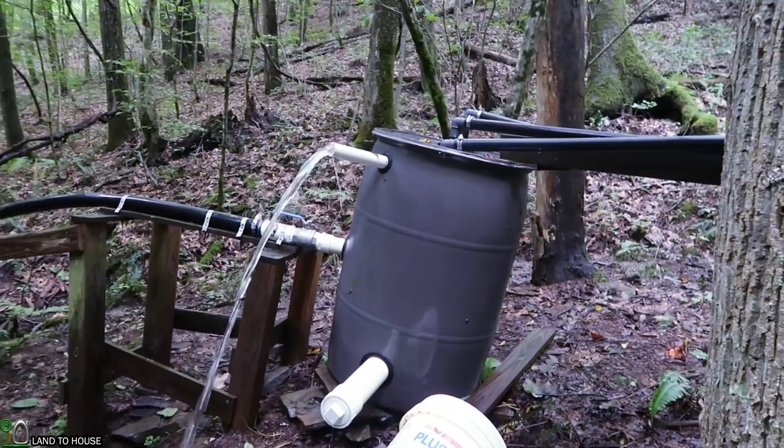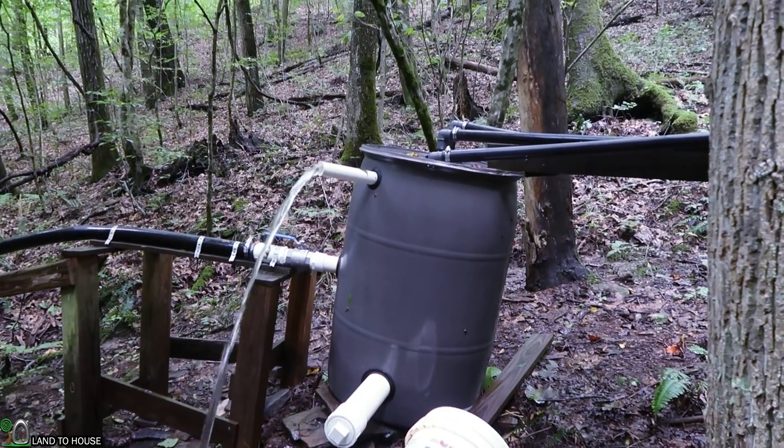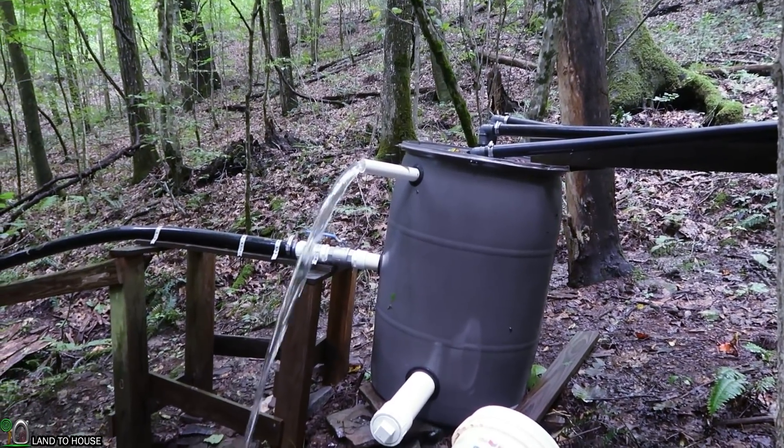If I can continue to use 300 watts all the time I'll be making $420 off of the hydro system. In the wintertime I really anticipate that I can add another 3/16ths jet and be making closer to 400 watts, which is going to push us well up there to $550 or $600 in a year. Super exciting — and I'm glad that we have this much overflow still. I may be able to use one more 3/16ths jet now; we'll just have to play around with it and see what we can get.